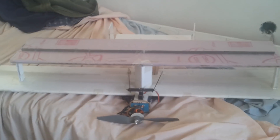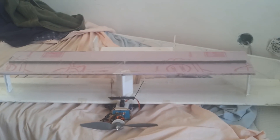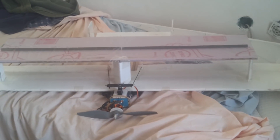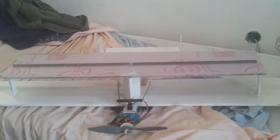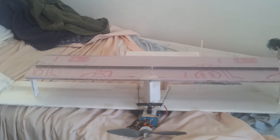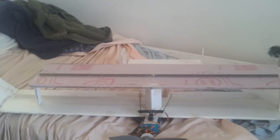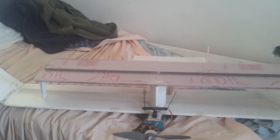The advantage of having this incredibly increased amount of wing area is, of course, you get extremely low wing loading. You can do really tight loops and extremely tight turns. And now when you watch those old movies about World War I airplanes and you see how incredibly tight they turn or loop, you understand why — because they've got these very low wing loading airplanes.